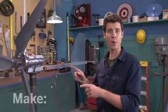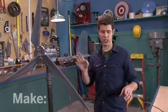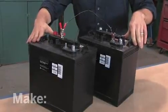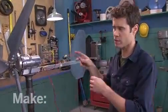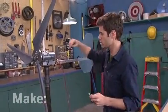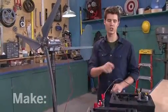The voltage produced by a wind generator is pretty uneven, just like the wind, so you don't want to plug a device directly into this. Instead, you want to use it to charge some batteries — in this case, 6-volt golf cart batteries, which are designed for a full charge and discharge cycle. If I were to hook my motor directly up to the batteries, it would just spin like a propeller. Instead, I'm going to use a bridge rectifier. This acts as a sort of gateway for electricity, keeping it flowing only in one direction — from the generator to the batteries.